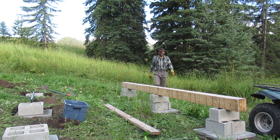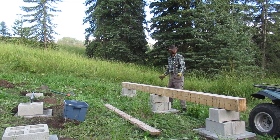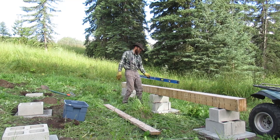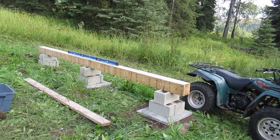So I'm going to have to adjust the position. I'm going to square the beams off — I'm hoping I can kind of lift up the middle and shimmy it back and forth if I need to. It should have a foot of overhang on each end. So it's not set exactly where it's going to sit but at least it's up on here now. It looks like I'm going to have to move it a few inches. It's level — so that's the first beam in place. It's a milestone.